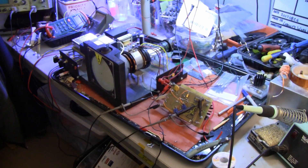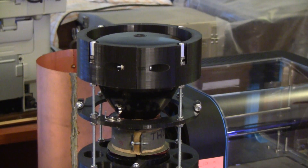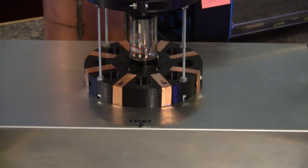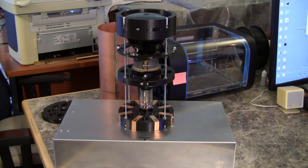Even when I copy a horizontal scan circuit, just because of differences in parasitic capacitance and lead lengths, layout is very critical. My circuits don't work and many times they simply go up in smoke. So far, I still have to physically assemble this whole unit, and it's come a long ways. The tube is in its supports and mounted to the aluminum chassis, which should be more than large enough to contain all of the necessary electronics. Currently there is very little in there but the AC entry module and the DC power supply unit. Hopefully in the weeks to come we'll have something operating that I can demonstrate. LabGuy out.